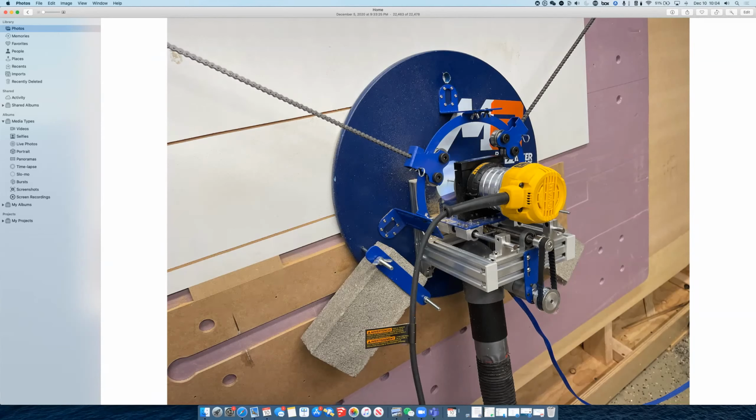it gives you the assumption that, okay, here you go, my weight is centered, gravity is pulling it down, everything is fine. But when you add the motion of the sled along with the rotation of the bit itself, you'll see that your sled kind of walks at times, where it'll rotate, and then that mass is no longer properly centered at the bottom. So by having these at like that lower third, it kind of mitigates some of that.